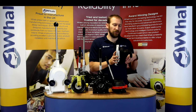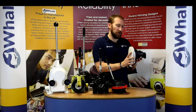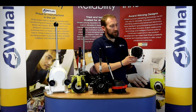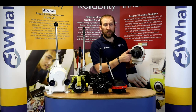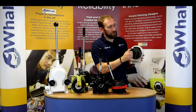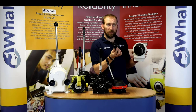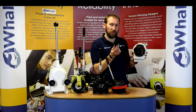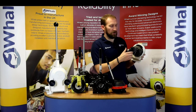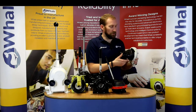This pump is very easy to install — you drill one hole in your deck, slide it in, push it down, and put two screws in the bottom. It's self-locating. Another nice feature is that the inlet and outlet ports rotate. It comes as one inch, but if you want one-and-a-half inch, you turn the port to face the other one, give it a wiggle, and pull it out. In the box will be a one-and-a-half inch port. You put it in the same way and now you've got one-and-a-half inch ports — very simple and flexible to install.